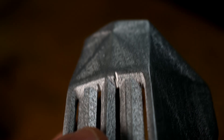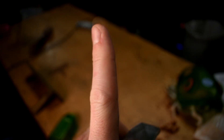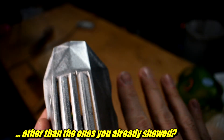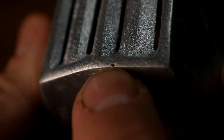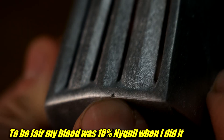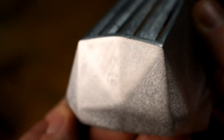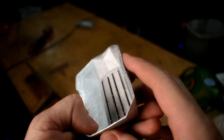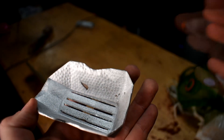Although you can kind of see the polygons — that's really cool. That's a neat stylistic choice. Another flaw right here — that was me being a little too careless with the Dremel cutting open the flashing from these holes. The one and only other casting flaw, which I could have ground out but didn't — honesty, or let's be honest, laziness — is down here. That's like a little air bubble or a tiny sand grain. I'm kind of disappointed with that. That's either sand that got washed in because I wasn't super careful cleaning up the mold, or it could have been an air bubble — it looks like sand to me. There must have been a grain of sand I wasn't careful about removing. Everything else looks really good. The backside came out pretty good too. I have a tiny bit of sand trapped there — same there. Those lumps were in the print though.